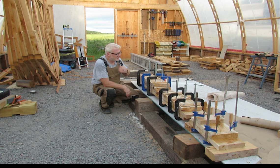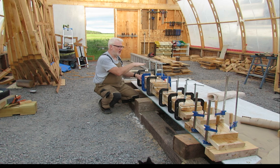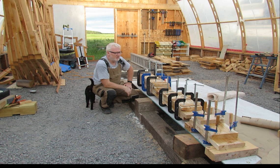The mixing went well. I'm finding I get about 9 feet of coverage mixing 100 grams of 105 resin and 20 grams of the hardener, so maintaining that 5-to-1 ratio. So that gives me a good sort of rule of thumb. Tomorrow when I epoxy these sections together, obviously I won't need that much, so I'll use just half that. The epoxy is pretty expensive, so I want to minimize the wastage, so that's why it's important to have a rule of thumb of how much coverage I'll get.